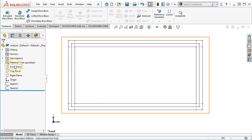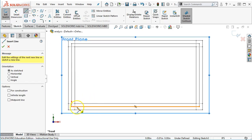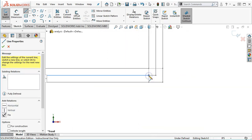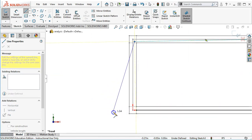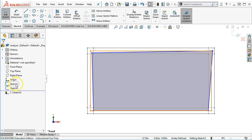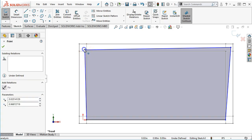of the part. So I need one more sketch, and to make this work, I'm just going to sketch from the min to the max. And then I don't want perpendicularity or horizontal, vertical. So I'm going to try and avoid those relations. All right, so if I get rid of the perfect form and hide that out, then within the tolerance zone, the idea is to play with, like I said, with the magnification of 10 times, if this was only 5 thousandths, we would only be moving about that much.